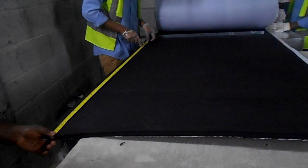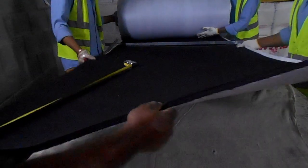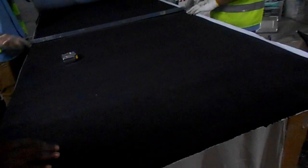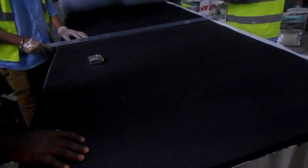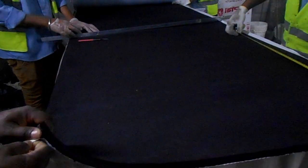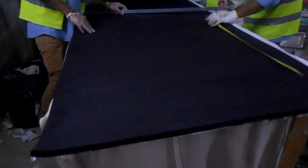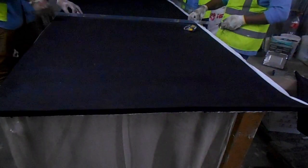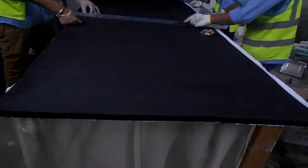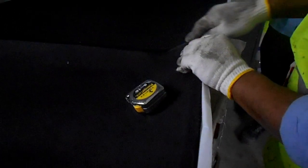Now this kind of insulation, the self-adhesive type, will take very little time. How, you will see in the further video. Why? Because it has self-adhesive. If you compare with the previous fiberglass insulation, those insulations without self-adhesive required separate glue. We need to clean the duct, we need to apply the glue, then apply this acoustic lining, then you have to wait a little time for the dryness. After completion of the whole inside four-area fixing, we will again do the canvas cloth for the corners.